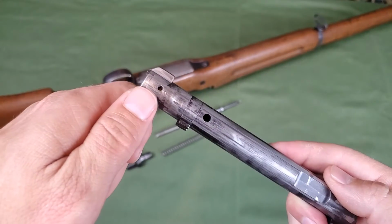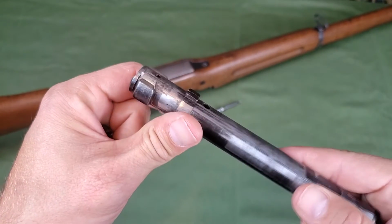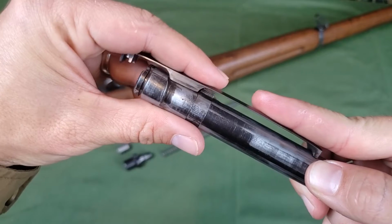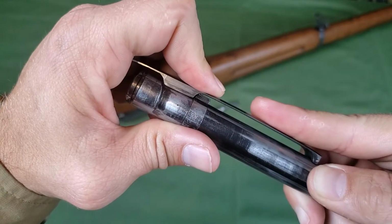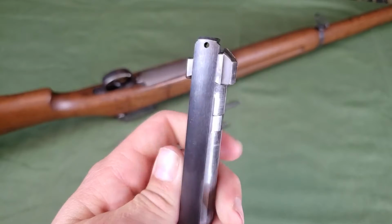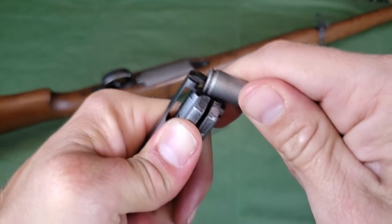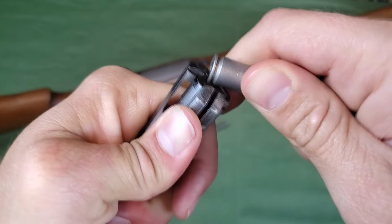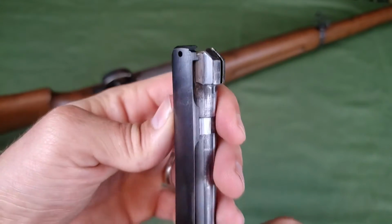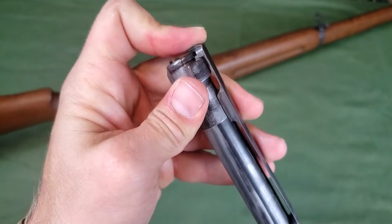Take the bolt and turn the extractor collar until its lug is in line with the gas escape holes. Insert the lug on the collar into the undercuts in the extractor by pushing the extractor to the rear until its tongue comes in contact with the face of the bolt. Press the hook of the extractor against a rigid object until the tongue will slide over the end of the bolt. Then turn the extractor so that it lies over the unslotted or solid locking lug.